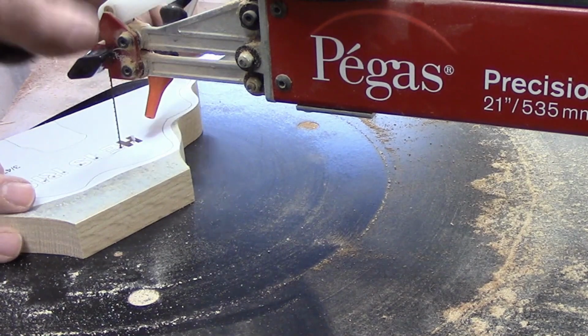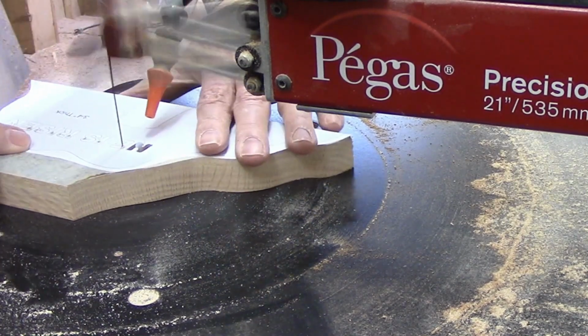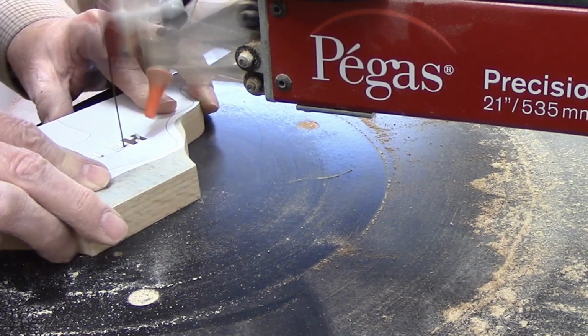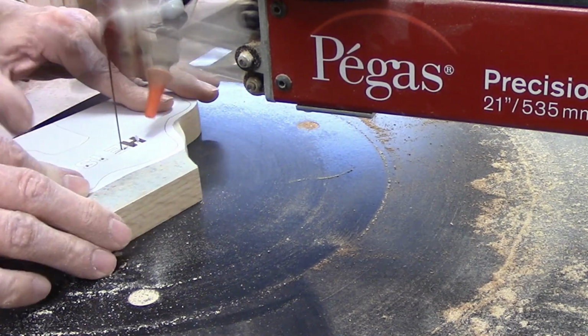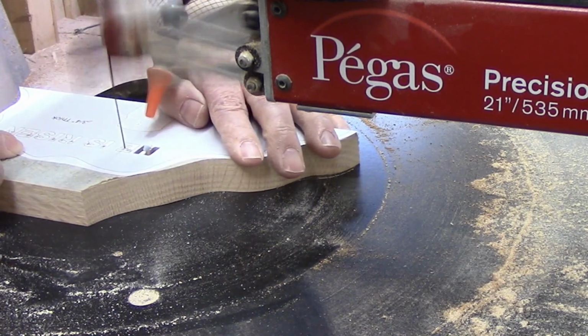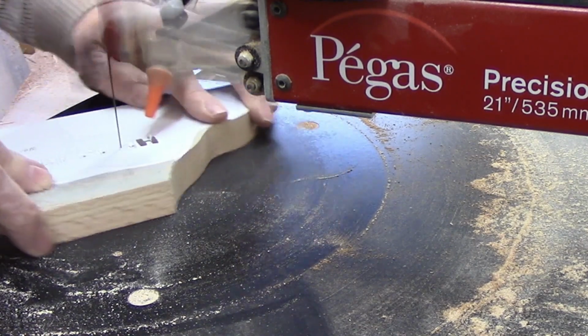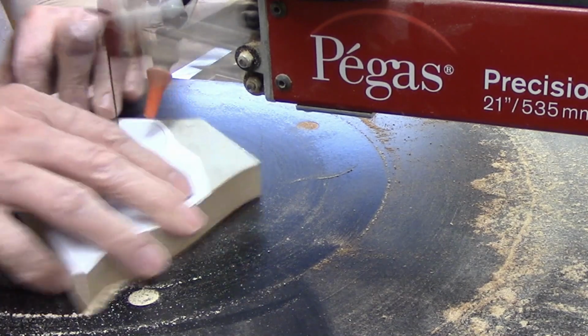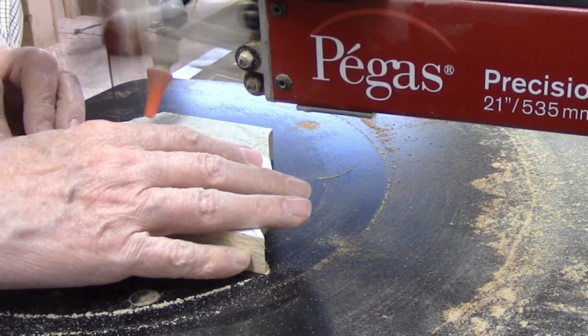distance to the corner. Once the blade touches the corner, you back it up very slightly, then you pivot the workpiece without the blade cutting. As soon as the workpiece is facing in the right direction, the next direction you want to cut, you start pushing the blade into the wood again. If you're new at this, I recommend getting some practice on scrap wood before moving on to finished projects.